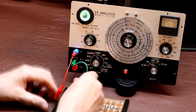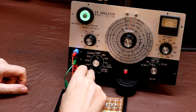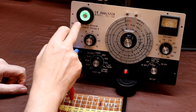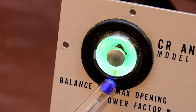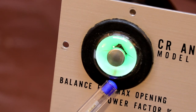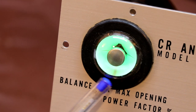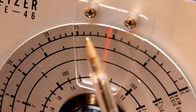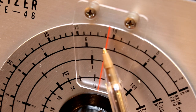Let's plug my little board in. In theory, we should be able to adjust the balance wheel until the number on it matches the multiplier, so on times-one when we spin to position 10, if the analyzer is working properly we should see the magic eye starting to open. We're looking for the little shadow at the bottom to get wider — as wide as possible. When we've got the magic eye as wide as possible we read off the dial to get the resistance value. The actual resistance value we've got here is 9.7 ohms, so the indicating dial is reading a little bit high at closer to 11.